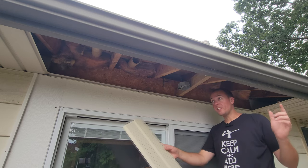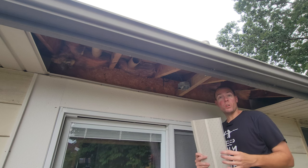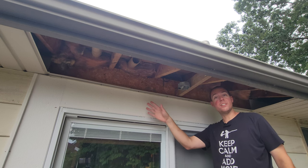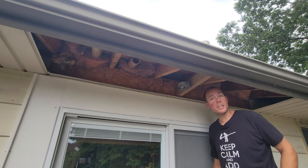When they originally built this house, they came from both ends and worked their way towards the bay window, which made sense at the time but now just leaves us with one choice. We're going to start over here, go that way, and cut what we need at the end and try to make it look as best as we can. These pieces we just pop up and put a screw in the side — simple as that.